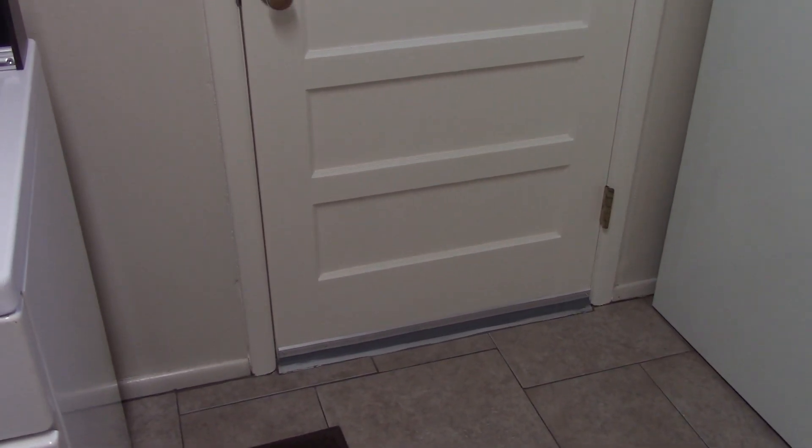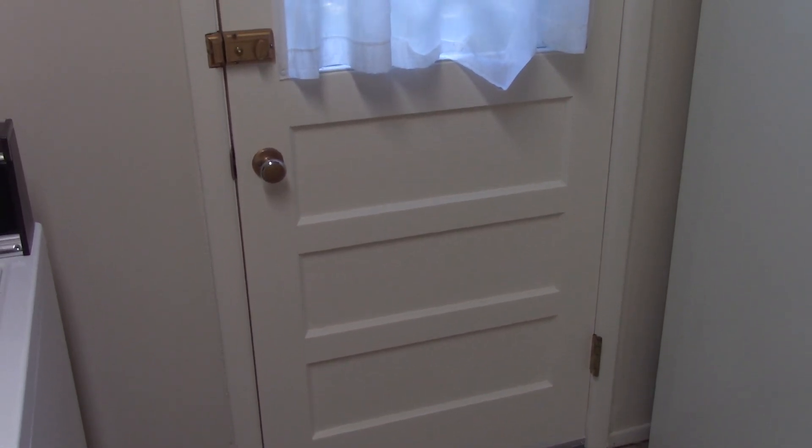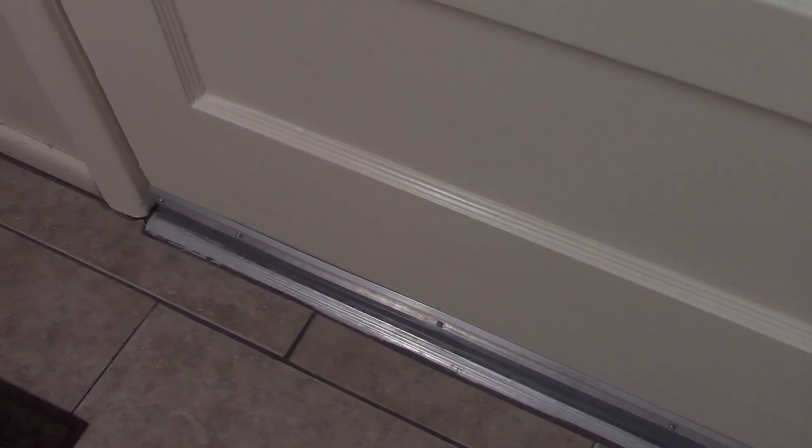It's a day or two later. Here's how the back door turned out — looks much cleaner and much better. Got the paint off the hinges, which looks a heck of a lot better. Lots of sanding — I've got a good smooth finish now, minimal brush strokes, but the fella can only sand for so long. New door sweep with no paint on it.